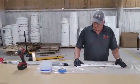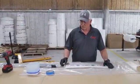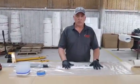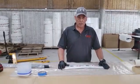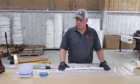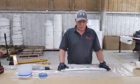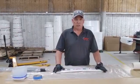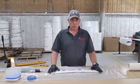We have some unique aspects to our pipe patch. I'm going to mix this resin and put it in. The uniqueness is that we don't touch our resin — it's completely encapsulated. So there's no worry about mess, guys getting resin all over the place. And more importantly, we can launch our system from a cleanout and push it into place, meaning no resin is exposed to the homeowner or the homeowner's property.